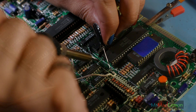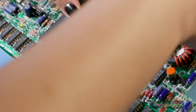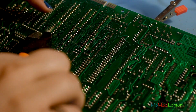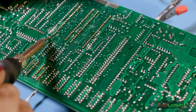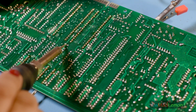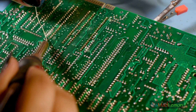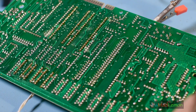Okay, elevate the board. Let me check the other side — sort that out. Which is already soldered in, to be honest. But let's trim it first. Heat it up and check that it's on the pad. Make sure there's no risk of dry joints. There we go. I'm just being very delicate, taking my time.